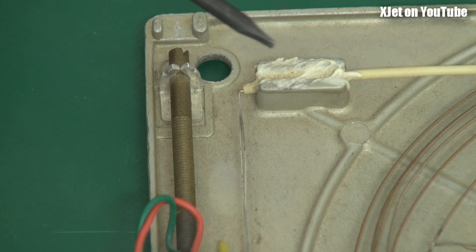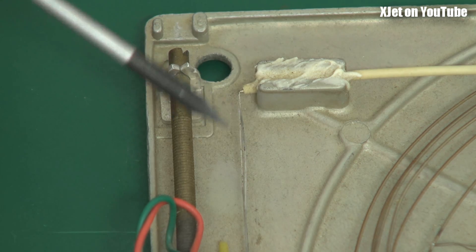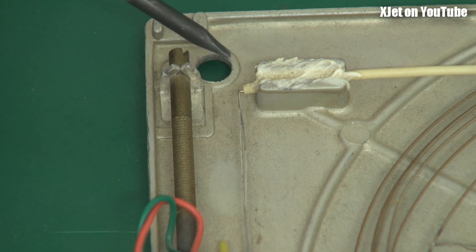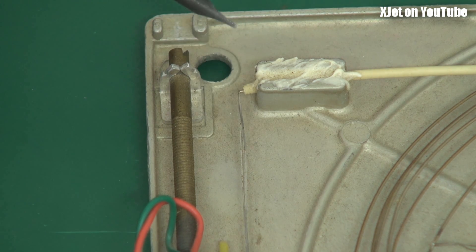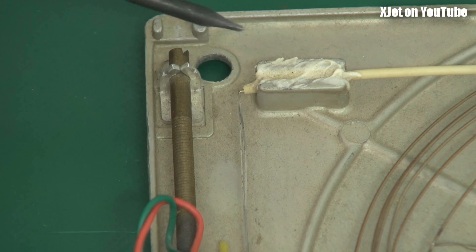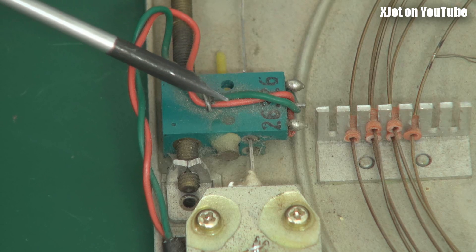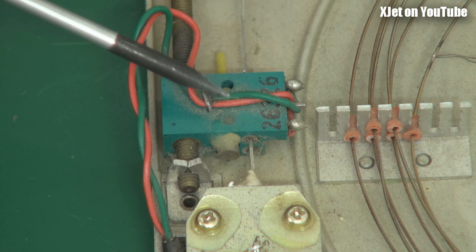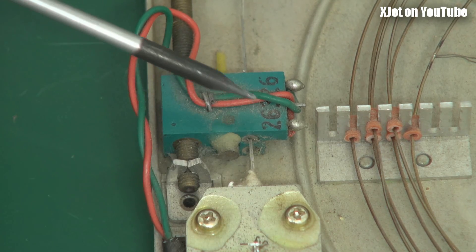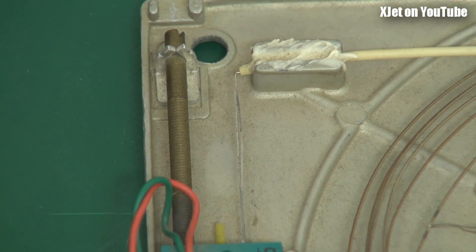Here is the end of the wire. The wire runs through this plastic tubing here and ends up here. You'll see there are a couple of little strips — they're actually little strips of nickel, two of them, one on each side of the wire. What happens with nickel is when you apply a magnetic field to it, it grows longer or shorter. The nickel strips run back into this device, which is a kind of electromagnet.